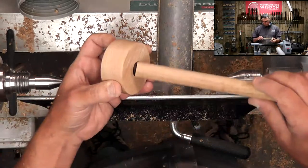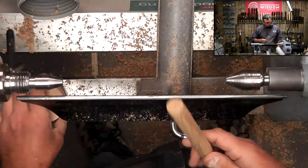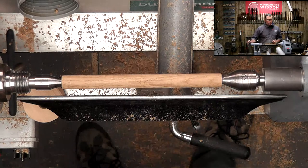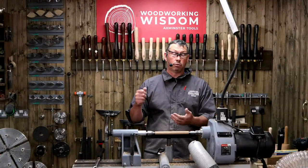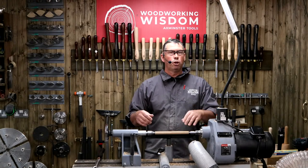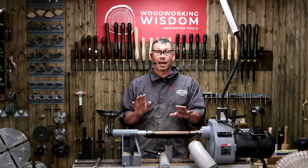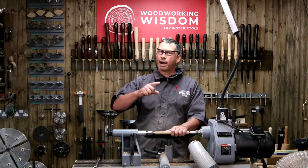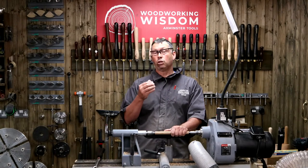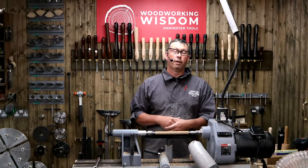Yes, Craig. A question from Frederick. What are the advantages of using a larger roughing gouge over a narrower one? The contact area with the wood must be about the same. Yeah, you're right. It's like using a big bowl gouge over a small one. You can get a bigger cut simply by pushing harder, and you'll progress that chisel further into the timber. So if you're doing a 4 or 5 inch newel, you'll need an inch and a quarter roughing gouge, and a half inch roughing gouge simply wouldn't be big enough. You'd be there all day because it can't physically take big enough cuts. However, the other way round, you can do a piece of jewelry or a lace bobbin with an inch and a quarter roughing gouge because you can be delicate with it and back off the cut a little bit. So that's the reason, really: bigger projects need a bigger tool to create a bigger cut. Otherwise, you'll just be there for longer.